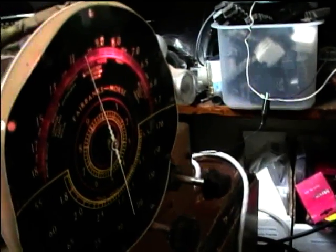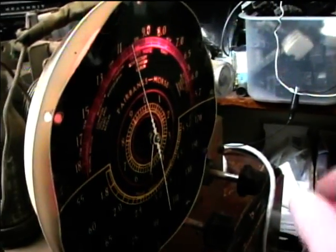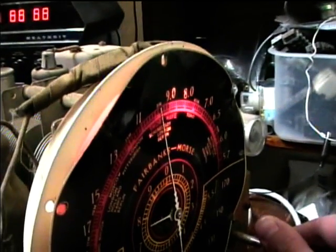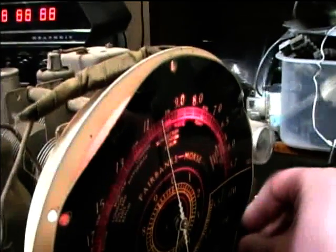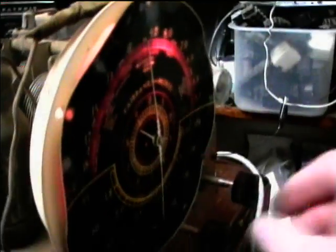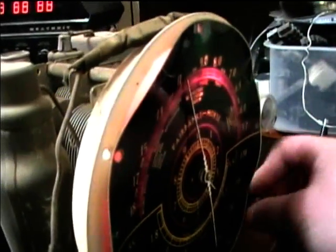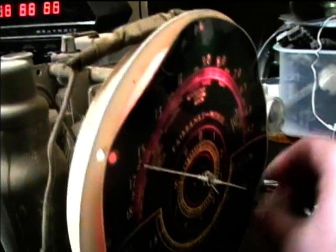I think this is the high shortwave band. The middle position is the lower one, but I haven't been able to pick up much on the lower shortwave bands. Let's see if we can get WWV. Let me go back to AM. Now I can tune the tuning capacitor since I lubricated it — picking up 1510 KMND on AM.